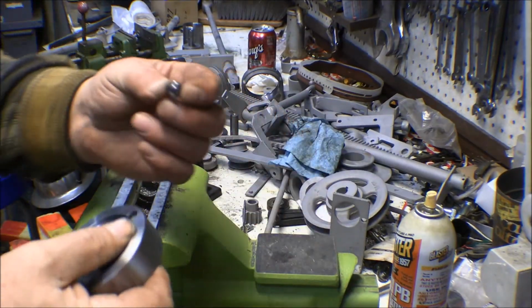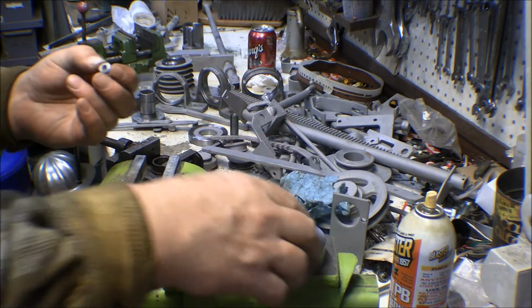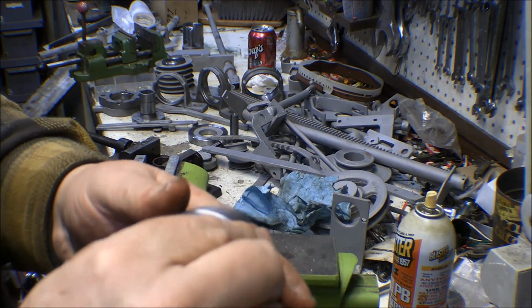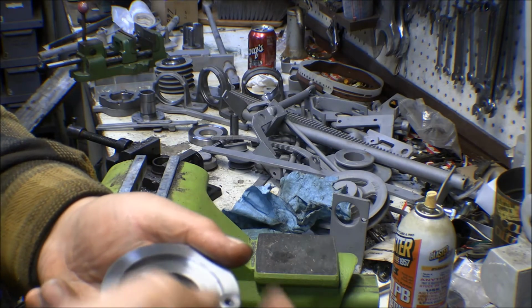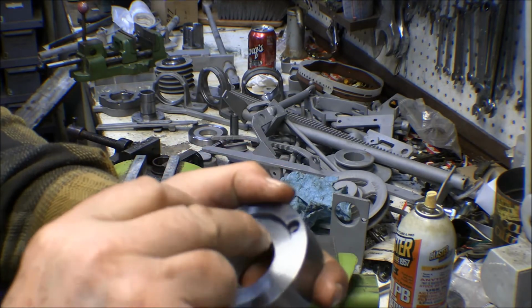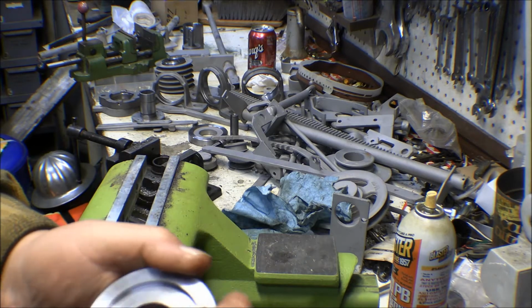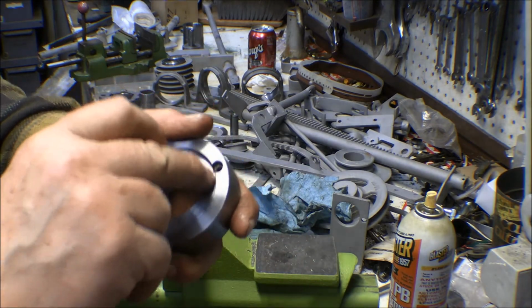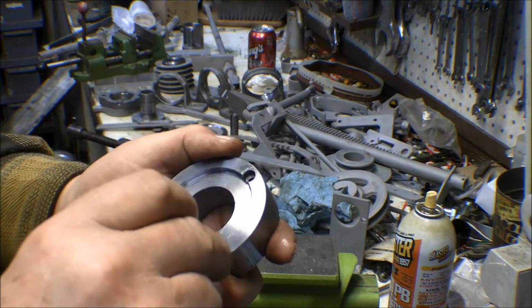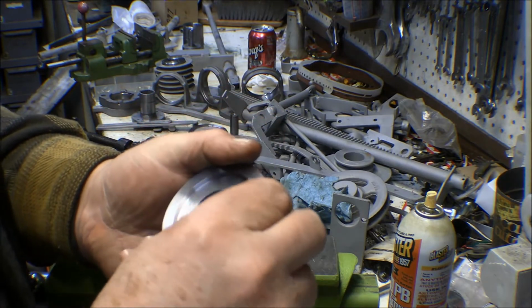Okay, that worked. I guess I could have put that in there with some Loctite and let it seat in here better. It wanted to come out with the drill bit as I was pulling the bit back and forth to relieve the chips, but it worked, and I got my hole centered on that piece of metal in there and that shaft, which is what the whole thing was. Now I can take a 5/16 drill bit and that'll follow that hole down through there, and then I can put a new piece of rod in there for the driver. So I'm happy with that.